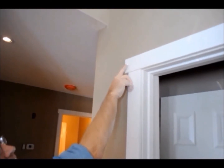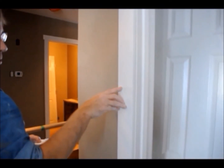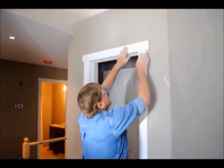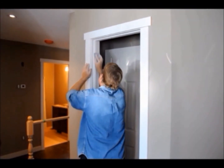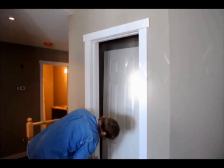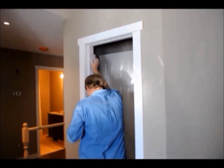Okay, what we have here is filling the holes in the woodwork with a fill product that's a non-shrink. Once you've done that, letting it dry. Okay, sanding them smooth after the patch and fill is done. So then it's ready for the next step, which is applying a bead of caulking to all of the wood-to-wood components as well as the wood to the wall.